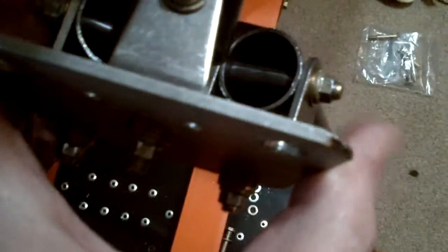So got stainless here. So the engine mount is officially completed. Also changed out this piece back here. I put some washers in here, left just enough slack for these two brackets to rotate. A 5/16 inch bolt, 5/16 inch hole. That's where the band on the rear engine mount will mount, and that will also be tightened up just to where it's got enough slip fit. So I'll push it all the way forward, set the band, because when the engine heats up and expands, why, it's going to lengthen, so it'll push back in that direction.